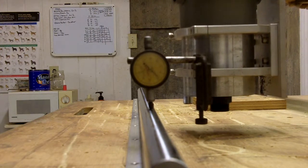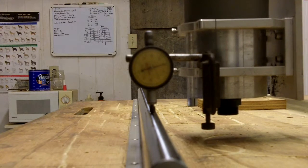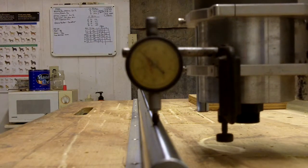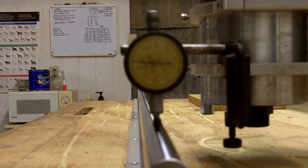These unsupported rails, I believe, have bent a little over the years. Been more than a few times that I've driven it into the table without expecting to do that. I'm roughly 150 thousandths out.